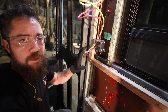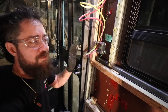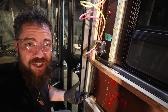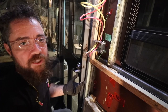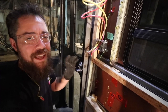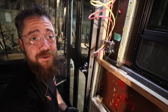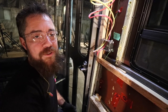We're using regular house wires here because we're using 110 volt for these because honestly, they're more reliable and they don't flicker like 12 volt might. So we don't wanna experience that. I know there's a lot of different drivers for 12 volt LEDs and for dimmers, but I haven't really seen any really good reviews. So we might as well go with something that has good reviews. And we're gonna have an inverter anyway and plenty of battery bank storage, so they don't use that much energy, guys.